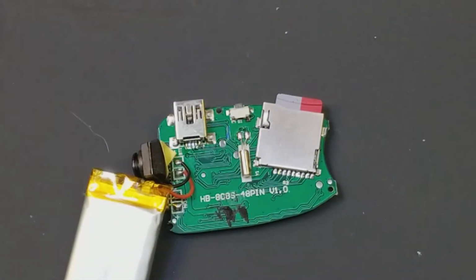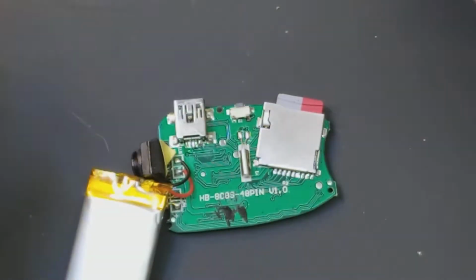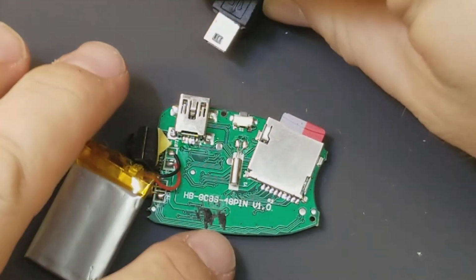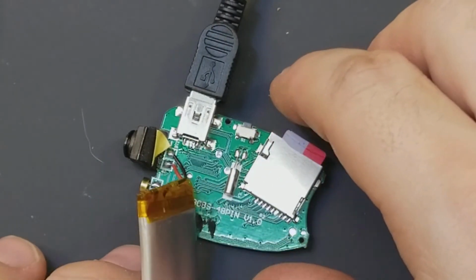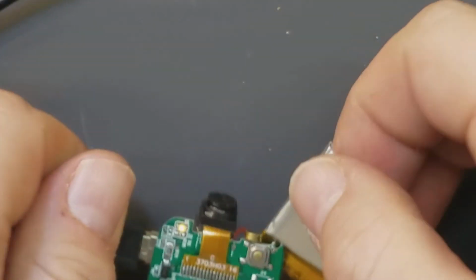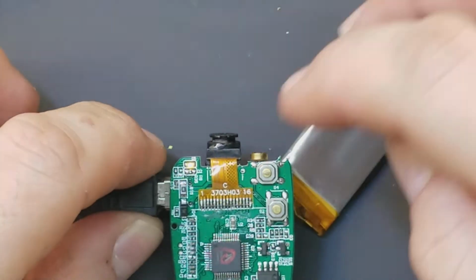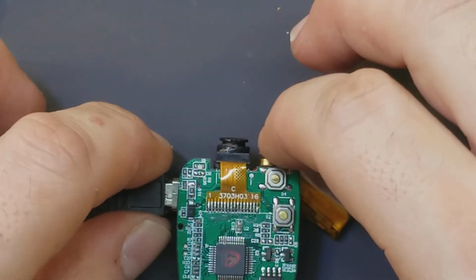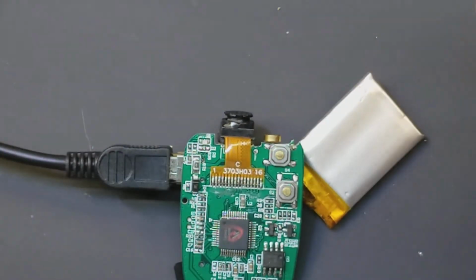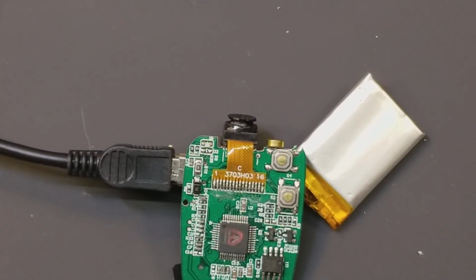Alright, that'll work. I'm happy with that. Pretty sure that will take care of it. Here's the charging cable. Let's just see if the charge LED comes on. Much better. Much better. Before, if I did that, it would kick in and out. So it did have some bad solder. So I did have a real reason to open it. Well, there you go. It kind of proves it. Always take things apart. Well, as usual, thanks for watching.